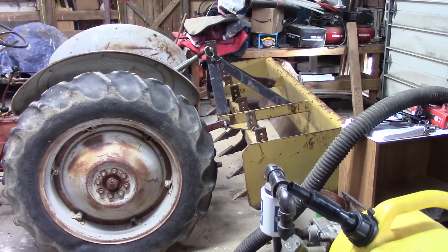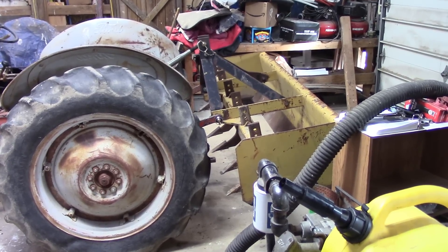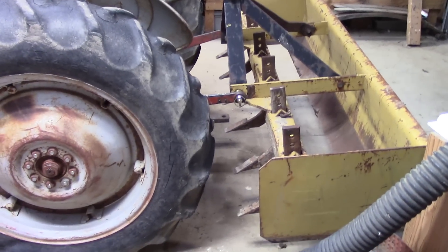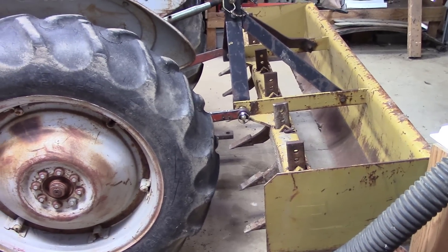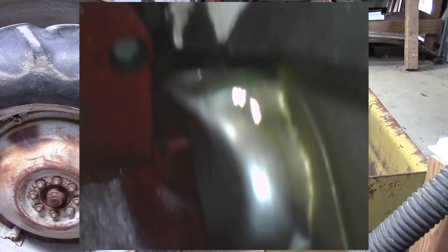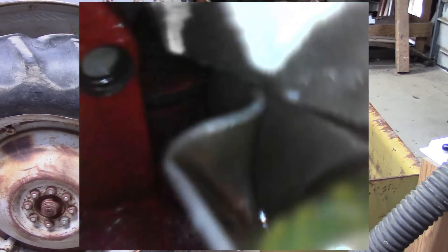I thought I'd better throw the box plate on there and check this side a little better. You can see how it's drifting down and then jerking back up — that's the problem we're trying to cure. The reason I put the box plate on was to try looking inside under a load, because in the earlier video we saw drips coming off the valve body but couldn't determine where it was coming from. As you can see in this video, that stream was just the drip in the front of the valve body — a steady stream coming out of what looks like a vent hole or something on the front of that valve body.